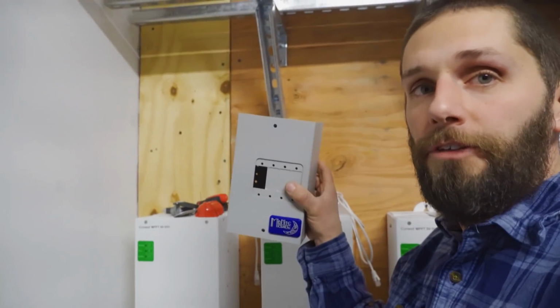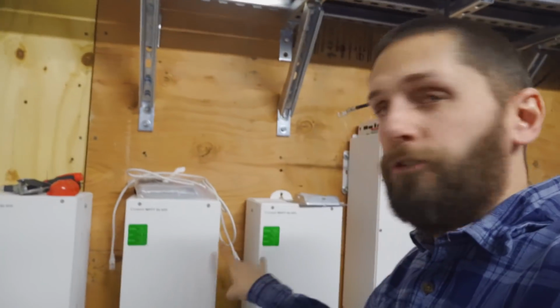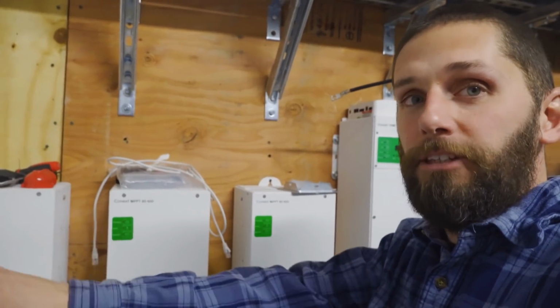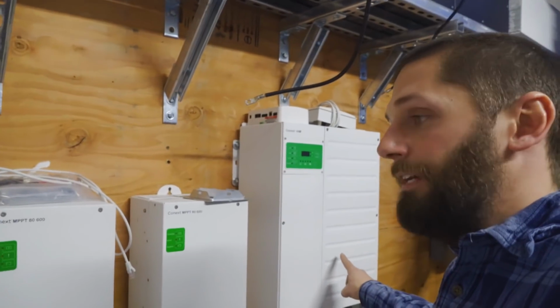So with what we have installed right now, that bottom box on the inverter is too small to hold 2 more breakers, and that's where this guy comes into effect. So get him mounted up, and it's actually going to control these 2 guys right here. So it comes out of here, back to the breaker, then to the inverter. That's how it's going to work.